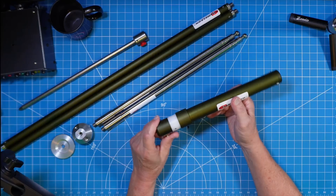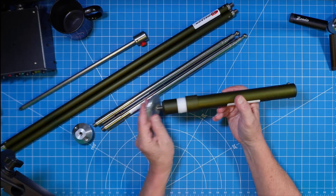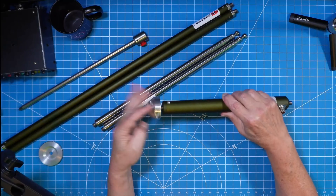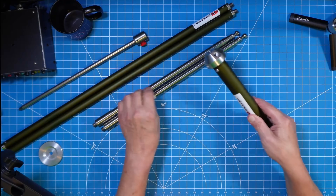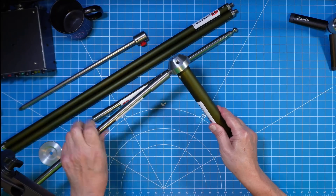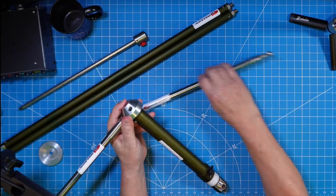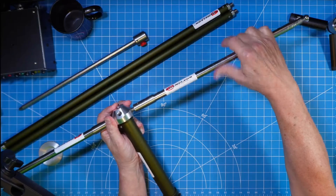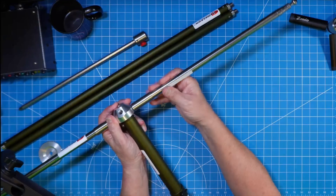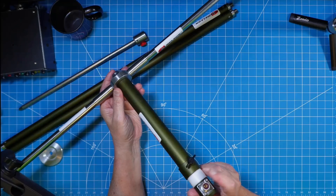You can deploy some competitive gear in there and it will still work. We're not going to use a radial puck, but you could put one on the bottom in case you have any difficulty with SWR. We're starting with the hub that comes with the tactical delta loop — you can also buy that as an individual hub. We're going to use two SS58s, which are 58-inch long telescoping whips, so that's why I say 58 inches times two — we're under 10 feet wide. We're going to use the ground spike and two single extensions.